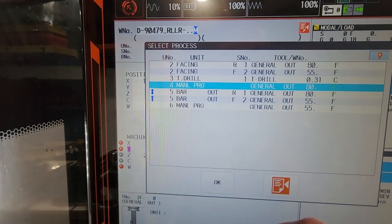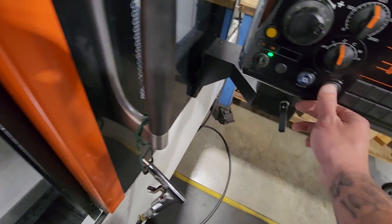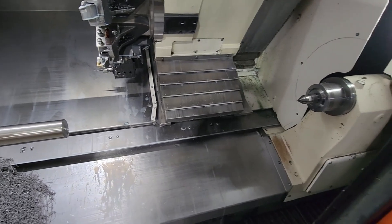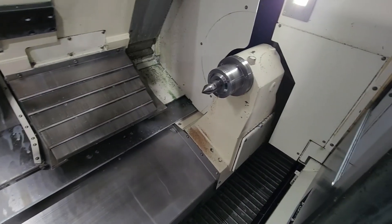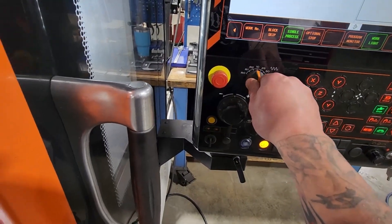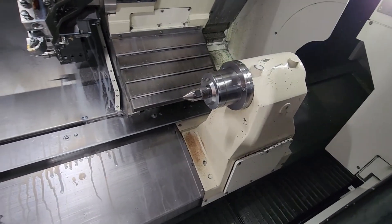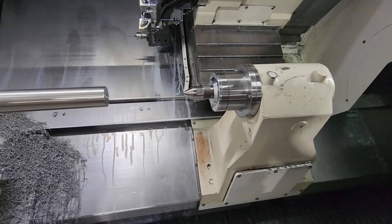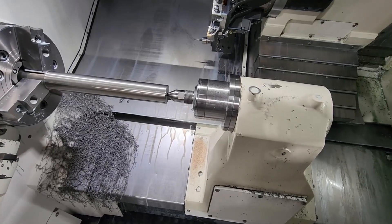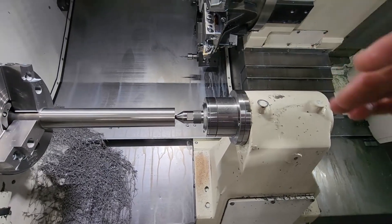So I'm going to go to number 4, I'm going to press OK. Now I'm going to press start. We have 82%. And I'm going to change the speed — you'll see how much faster it's going to go. So this is 50%, and it's going to slow down right before the part. Start — and now it's engaged. Automatically the tool will come and start cutting.